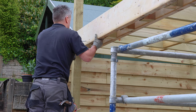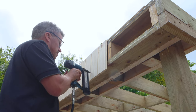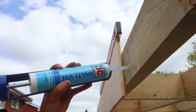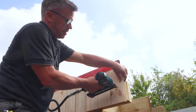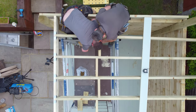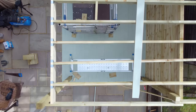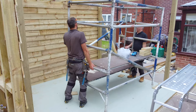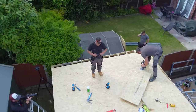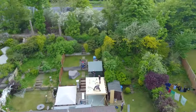Noggins were fitted in between the main front post, then that was doubled up and cladded with some nice tongue and groove, held into place with multi-use adhesive and a few pins until dry. A couple of noggins in between all the roof joists to stop them twisting. After a quick reposition of the scaffold tower, we boarded over the roof using 8x2 sheets as the weather looked like it was quickly changing on us.